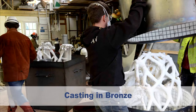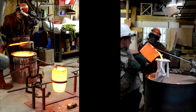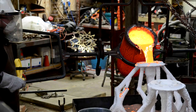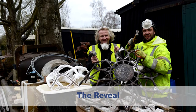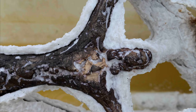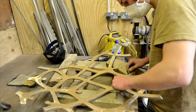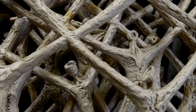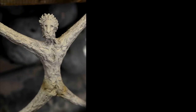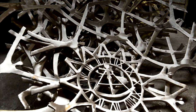So we've poured it, it's cooled down. Then we need to get rid of the ceramic shell off the bronze underneath — this is normally done by sandblast. Then these guys had to polish all the inside. Every piece had to be refined and polished up. And this is going to be in a public place, so to make it smooth, we're having to soften all the edges without roughing up the inside.